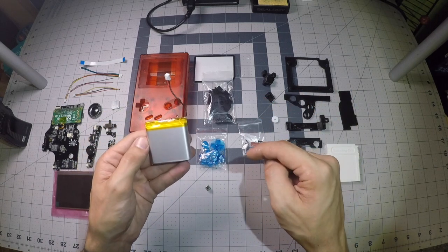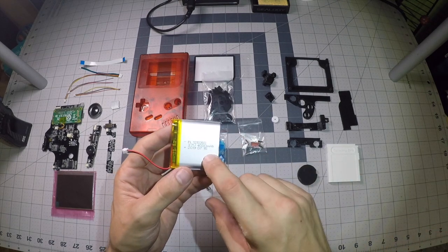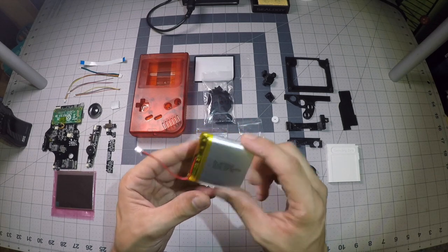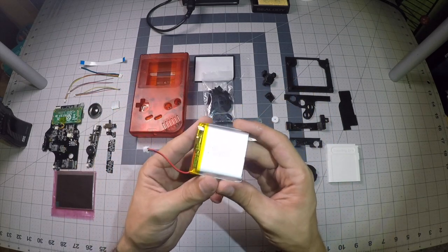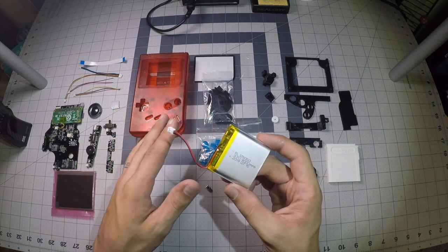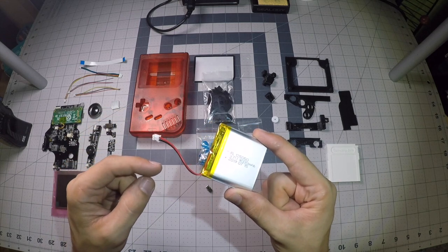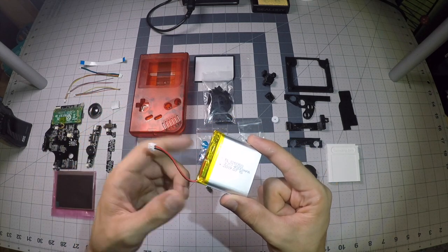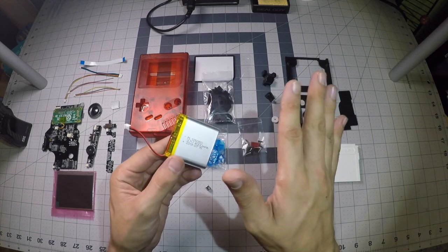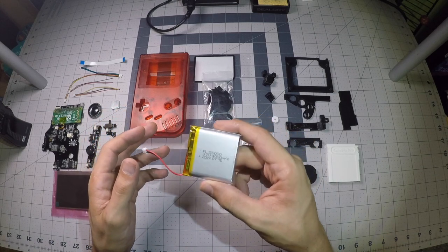I'll throw links in the description for everywhere I got all of my stuff. For the battery, I got a 4,000 mAh LiPo off Amazon. Just to give you a heads up — if you order this battery or many like it with a JST connector already attached, you have to reverse the polarity. That is very, very important before you even attempt to plug it into anything. For some reason all of these batteries coming out of China will have the polarities reversed. I've already made a video showing how to reverse the polarity; it's super easy and I really recommend just doing it as soon as you get your battery.